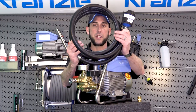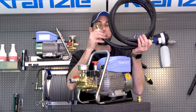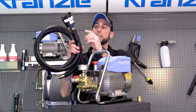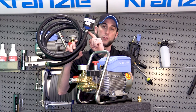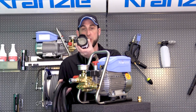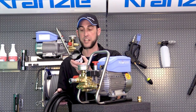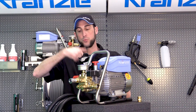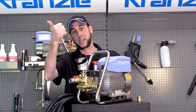This assembly right here comes standard in a 10-foot length. It's hose that we crimp ourselves on one end, and then you have the ability to shorten it on the other end with your hose clamp. This component right here is both a strainer assembly as well as a check valve, so once water feeds through this side, it's not going to drain back through.